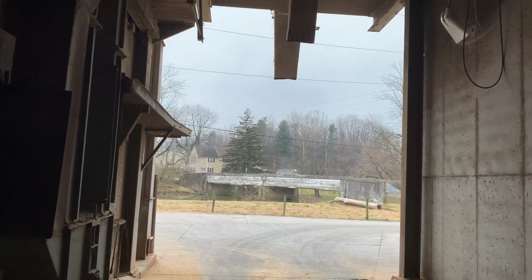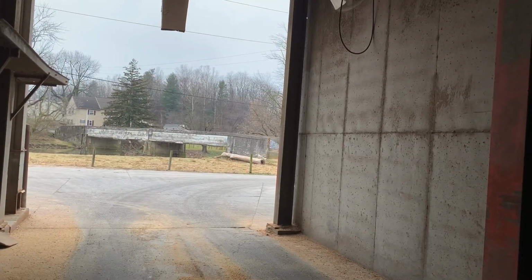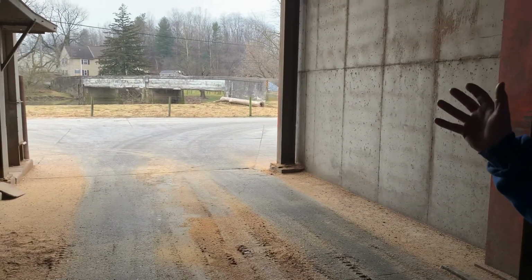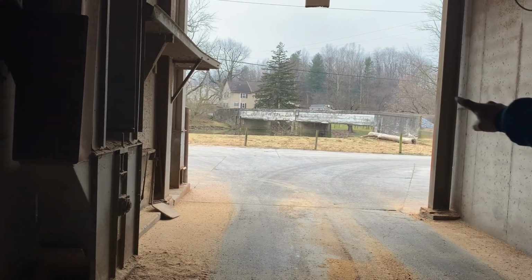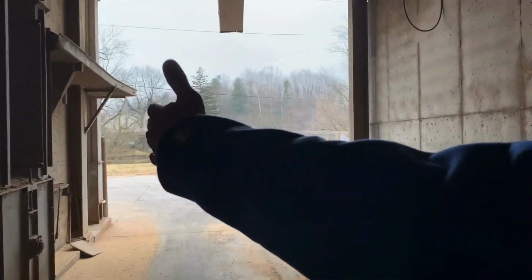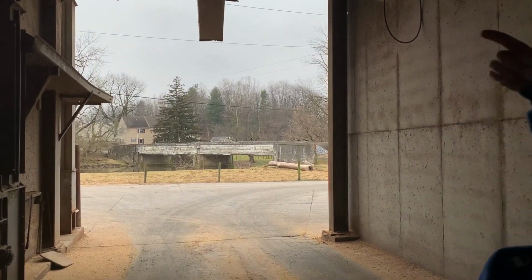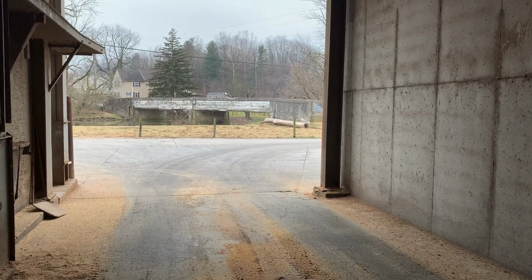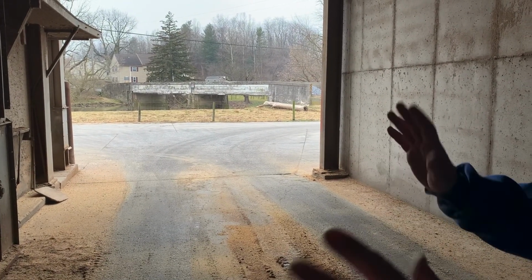Have you ever looked into one of those automatic conveyor type truck fill systems that will pre-weigh and fill different compartments without moving the truck? We're actually looking at that right now. We were thinking about putting the floor scales out there and then filling it in so you can back in the drive, having an easy flow from all these bins out to one that we run that way. You weigh your truck, move it around wherever you want, drop it, have it weighed and everything. It'll save you a lot of driving back and forth. We're not doing it yet, but we have a plan. We have it drawn up.